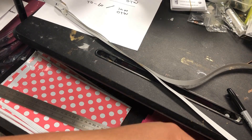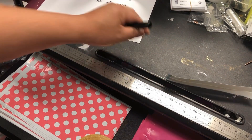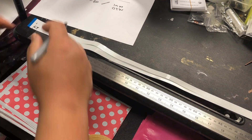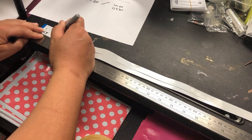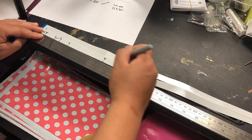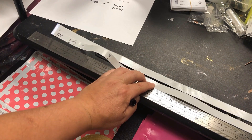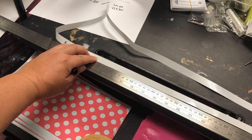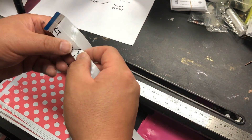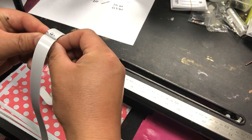Now the RT cable is done. Step two: take out the long cable and mark it LT. Fold number one is 15-millimeter vertical fold outward. Number two is 50 to 65-millimeter forward outward. Number three is 65-millimeter vertical inward. Number four is 90-millimeter outward. Number five is 183-millimeter outward. Number six is 225-millimeter vertical inward. Number seven is 240 vertical outward. And number eight is 775 to 790-millimeter backward fold inward.